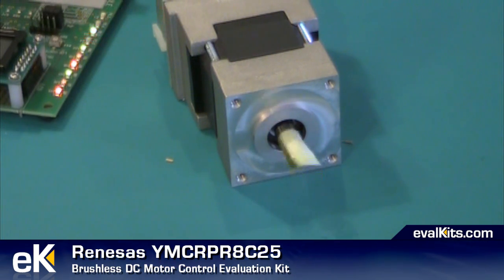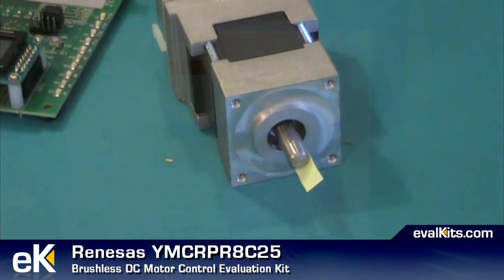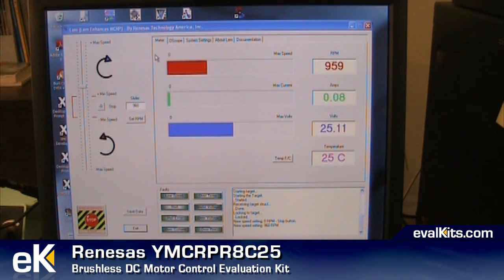A little kick, and the motor starts. Now, why does that happen? With back EMF, you have to have some EMF to sense, and you've got to figure out where the motor is. So what you do initially is rotate that motor through the coils so that it's in a known position. From there, you can start it clockwise or counterclockwise. You need that initial kick in your firmware to put the motor in a known position so that you can start it at the RPMs you select. That's something to keep in mind when using the back EMF method — you're going to get that slight motion in the motor.